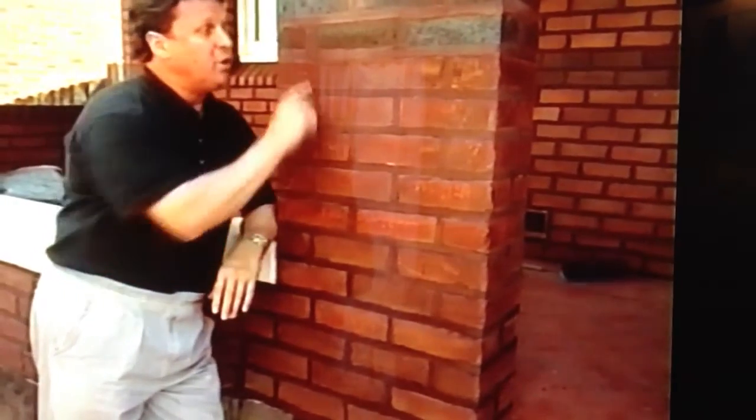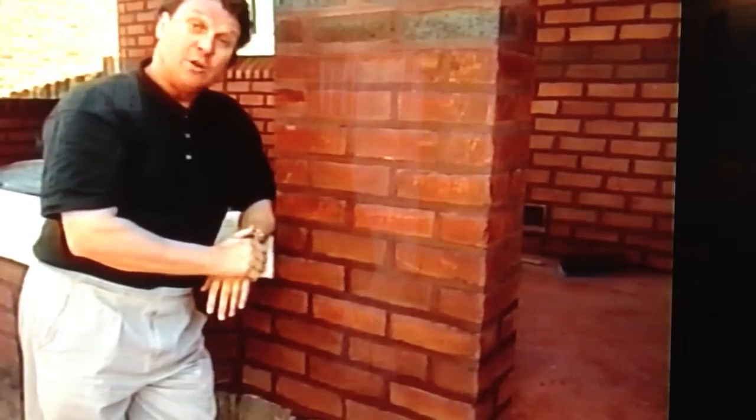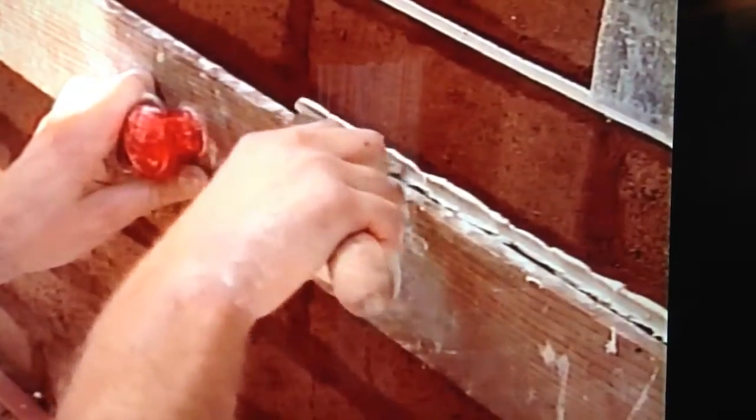Now that that's done, we're ready to put the white lines on top of that mortar, and when it's finished, your eyes will focus on the new straight, horizontal and vertical lines. The white mix is applied using a leather board and a tool called a joiner. This is when skill and patience is required — it's deliberate and time-consuming, much different to the modern technique used to repoint.